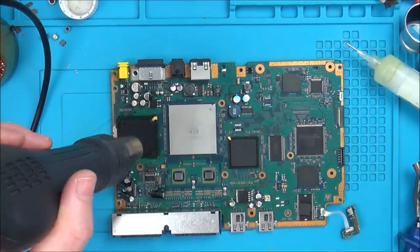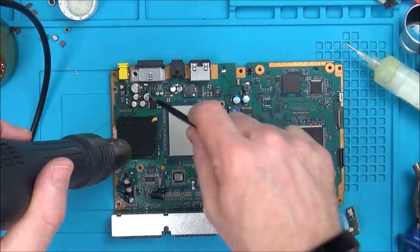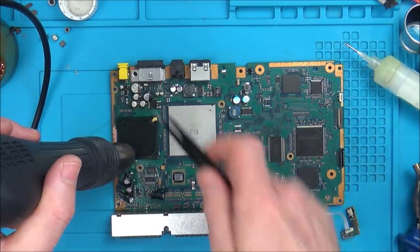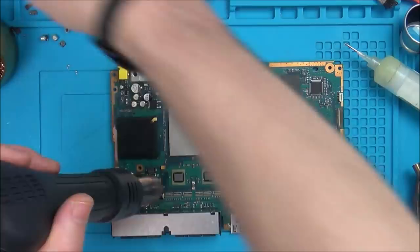I've spent far too long on it, and I'm just going around in circles. No matter what I do, it's not making any difference. There's no point in changing these over, because remember, I've traced the signal, and it only goes through one capacitor, which I have changed. Then it goes into the chip. So the others are going to be for RGB and stuff like that.